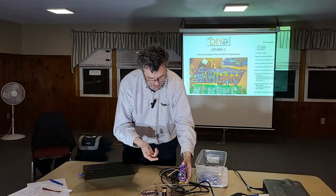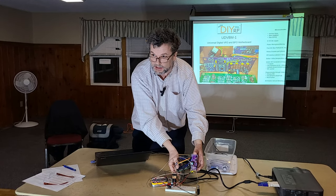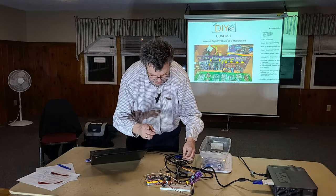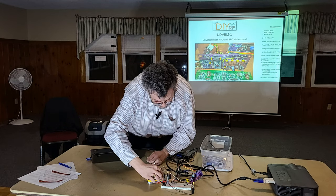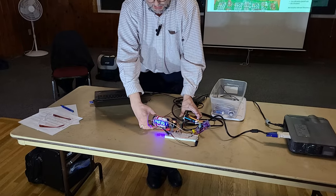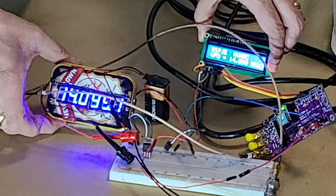This Franken-spaghetti I've got here is basically just me taking the I2C bus and driving one of these tiny little LCDs. I need a regulator because I need five volts to make the backlight light up - this is a 3.3-volt board, so I generate five volts separately. It all runs off a little 9-volt battery. What I loaded before I came here is a little program - that's the RF output from the frequency counter, and every one second you'll see it click up by 10 kilohertz.